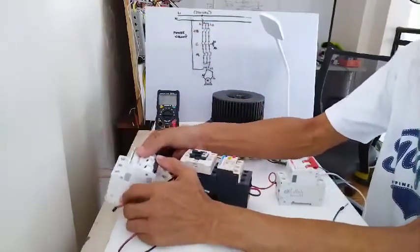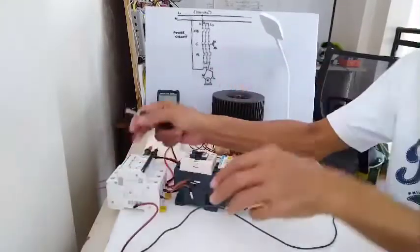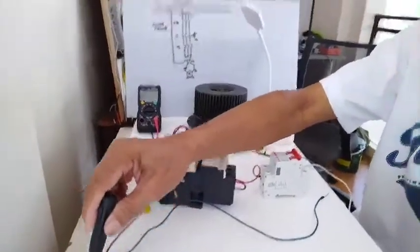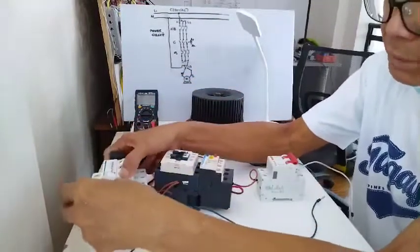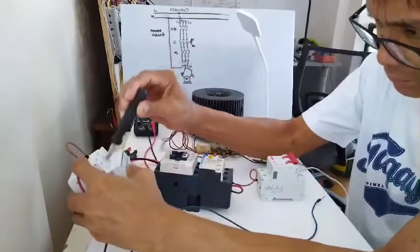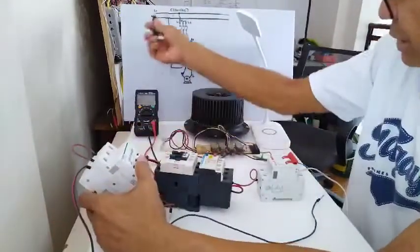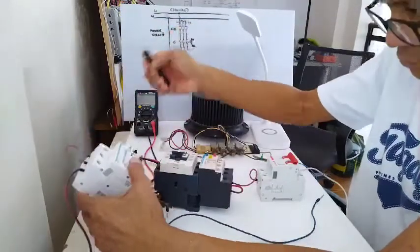Now I will provide my line. Here is my power source — this is single phase, line and neutral. I provided already the cable to be connected to my line 1. So let me connect it there. Line 1 is connected to line 1, then I provided already the jumper from line 2 to line 3.